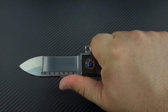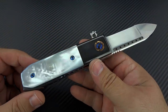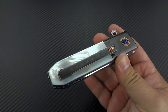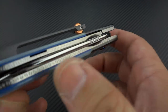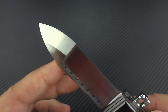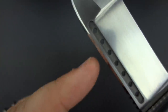All around it's a really cool design. It's a blocky design — meant specifically to be that. He does do blocky designs; he also does organic designs, very soft and flowing. It's just the nature of this particular design. I think it's a phenomenal use of materials and a phenomenal use of his time putting in all of this detail work and polishing. All the liners here are a very high satin, and then you've got the spine of the blade mirror-polished going into a hand-rubbed satin on the flats. He's left the high belt satin on the forward grind and on the tip grind — so you really have five different finishes on one blade. Very slick, very cool.